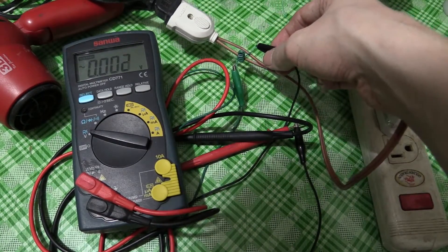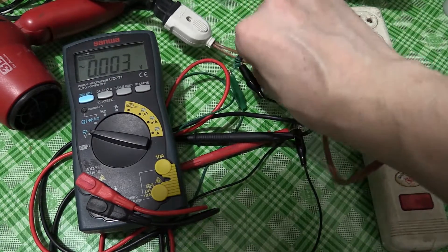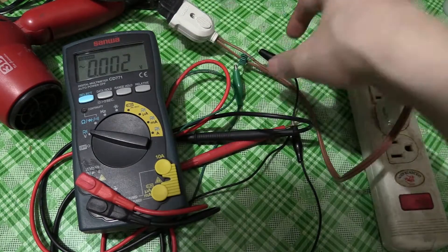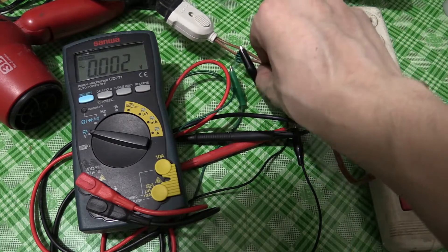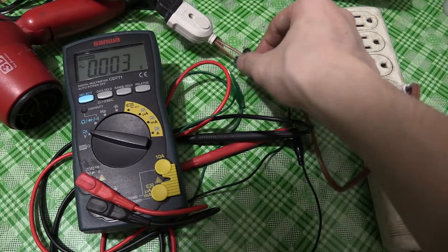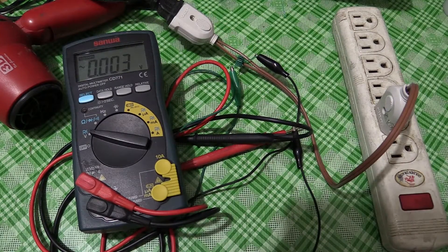You can monitor roughly what stage a device is in, or whether it's on or off. All you need is a toroid and a little bit of wire wrapped around it, and then monitor the voltage — feed it into an Arduino as an analog input, monitor that, and you might have to amplify it. But it's pretty simple and a cheap way of doing it.